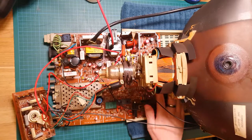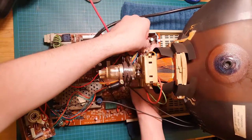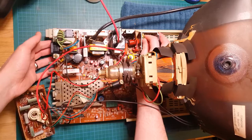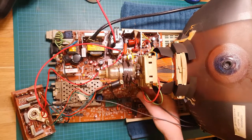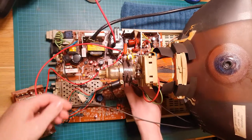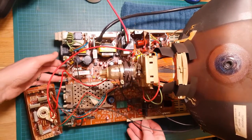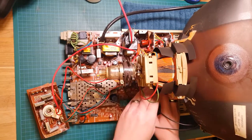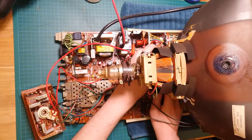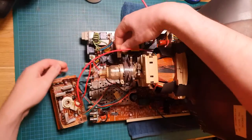And there are the color controls here. So this 4-pin connector goes at the front here. And it can only go in one way because the red pin here is a little bit further from the others. And then there is the power LED, which is a little orange and black lead here, a little 2-pin connector, and that goes to a connector just underneath here, right there. So now we can slide this in a little bit farther. Now we just need to make sure as well, there's a little wire clip on the front here that these wires need to go into just to keep them controlled and out of the way. And then when this is back far enough, we can get the degauss coil in.